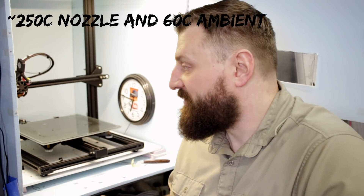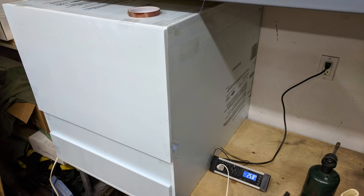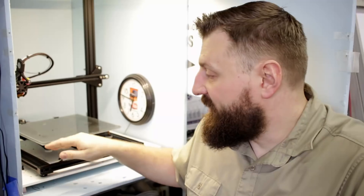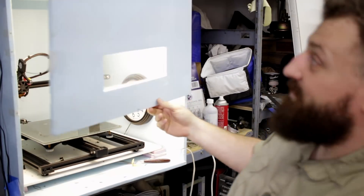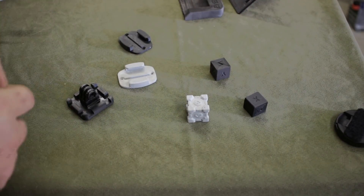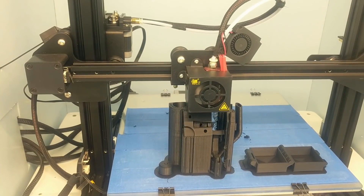To print ASA you need higher temperatures, and to maintain that I've built a styrofoam enclosure box out of blue styrofoam sheet, then placed a two-foot square 250-watt ceramic heater underneath the printer. That's temperature-controlled by a thermostat to hold 60 degrees, so once I close the door it's basically like a giant man-sized easy-bake oven. And boom — just like that I was printing parts like a crazy man.